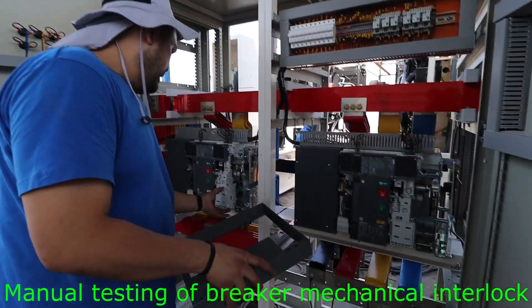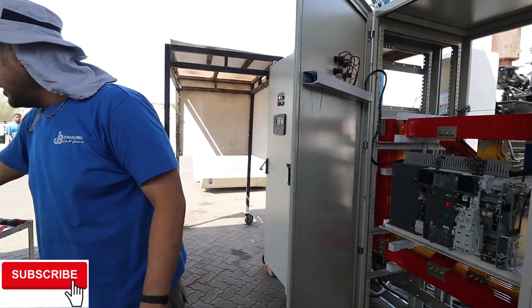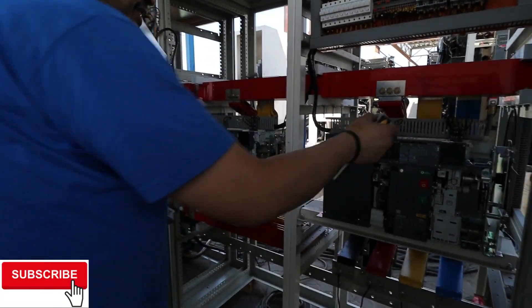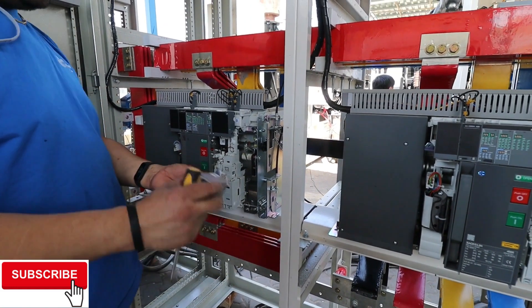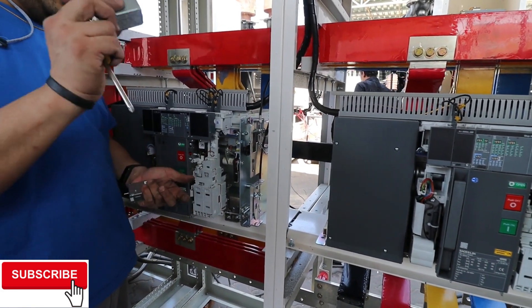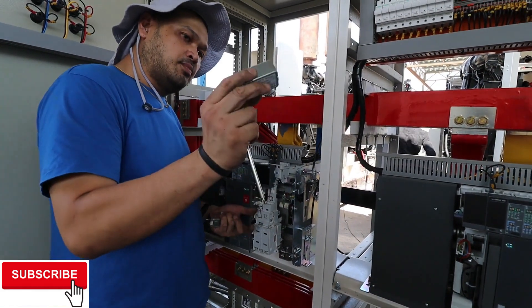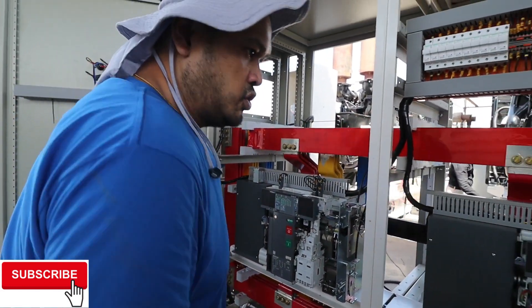Let's go outside so we can start with this one because they are in a hurry — today is also the delivery for this generator. By installing the mechanical interlock, you must first remove the electrical interlock, which is the undervoltage. You need to remove the undervoltage first in order to work with the mechanical, so you can test. We all know that if there is no power, you cannot open or energize your breaker.